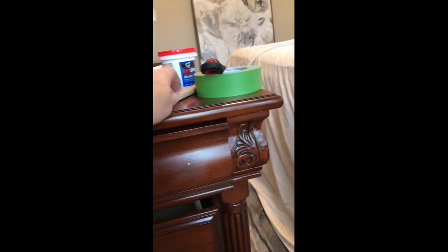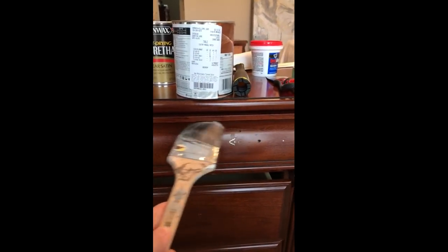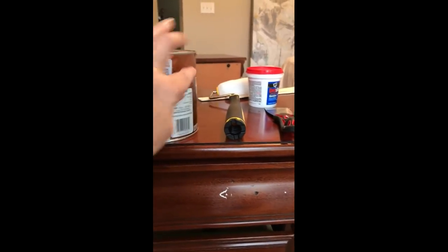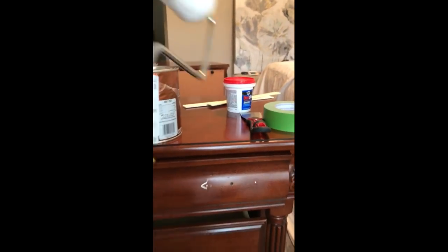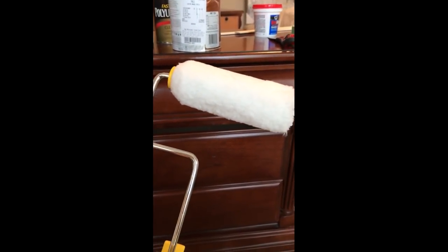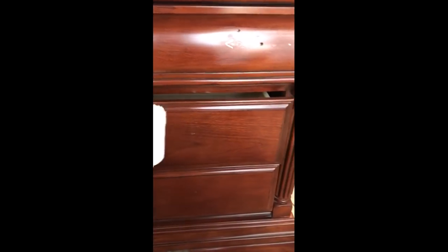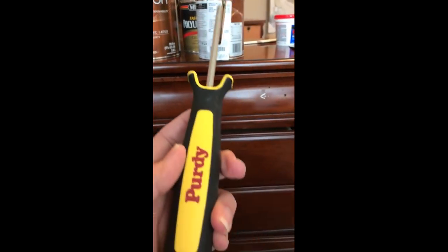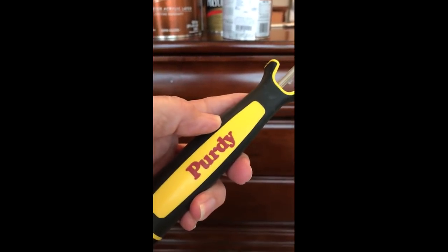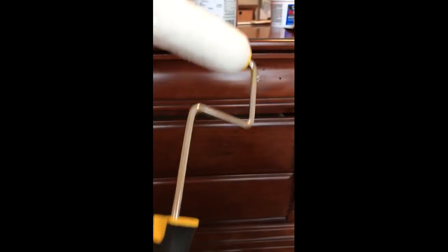When I paint, I cut in with an angled brush — all the places that are not flat — and then I do one side at a time. Before it dries, I'll roll the flat part. I've used these kinds of rollers before and had trouble with them gunking up and smearing the paint, but the guys at Sherwin-Williams recommended this brand of roller — he said it does a good job of not gunking up and actually rolls. So we'll see how it does — wish me luck.